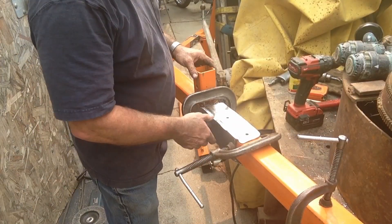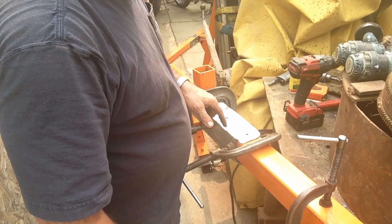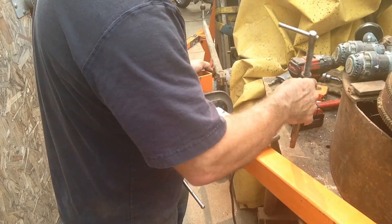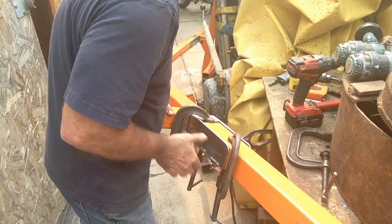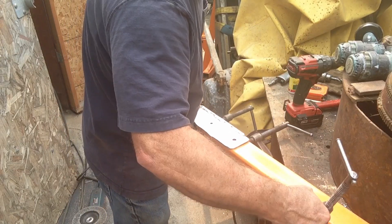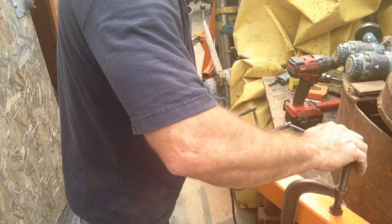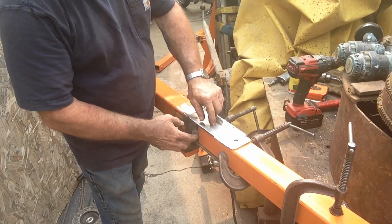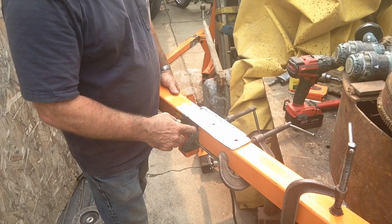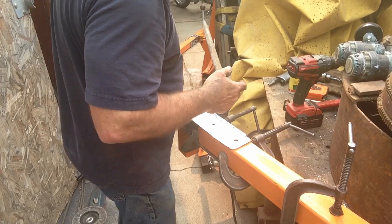Here's what I ended up with at the end of the day. I've got my brackets, already drilled the two holes on this side. I'm going to flip the whole assembly over and drill the other two holes from the other side and match them up. It pivots right here — this locks them in place. I started off with a little more than a quarter-inch gap on the other side and ended up having to open it up to about a half inch, because it needs to be relieved on the top and around the bottom so it will pivot up.